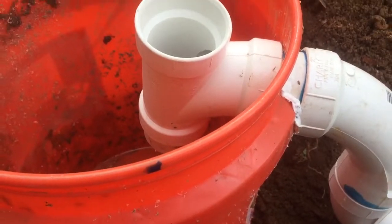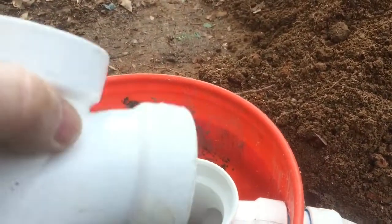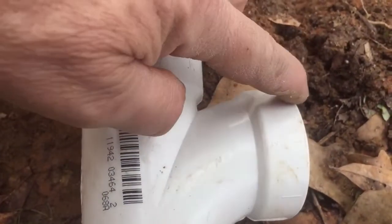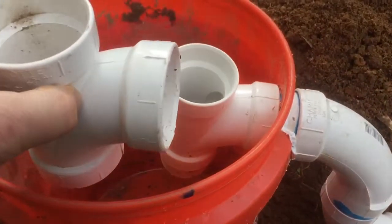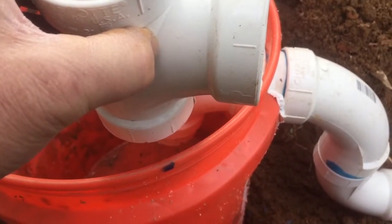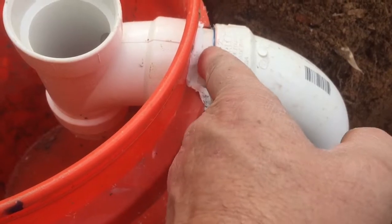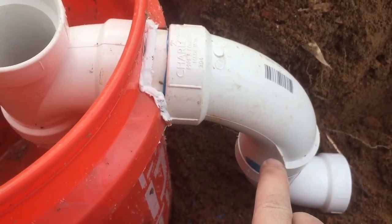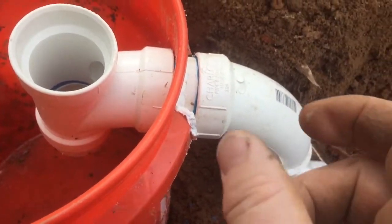I got my sanitary tee — that's what this is right here. I attached a two- to three-inch piece, glued it in, and let that piece stop there while my two-inch pipe extended out. That let me glue my long sweep 90 on there and then glue my other 90 onto that one. You make that little connecting pipe short so it holds it all together.